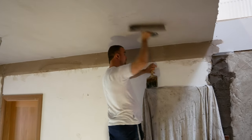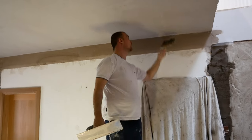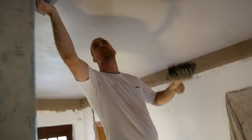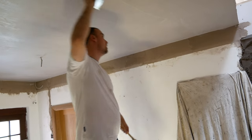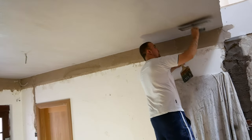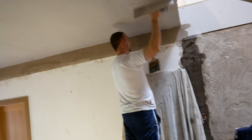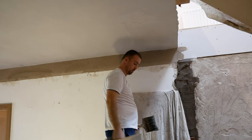You can't really get that just from watching a video. You kind of will have to get dirty, get the hawk and trowel going, and stick your fingers in the plaster and go, right, that's very soft, that's okay. Then you'll feel it firm enough and you say to yourself, right, that's it getting firmed up, now it's time to flatten it in. And then you feel it again and go, right, it's getting a lot drier, just less moisture coming off, maybe time for another wet trowel, and so forth.